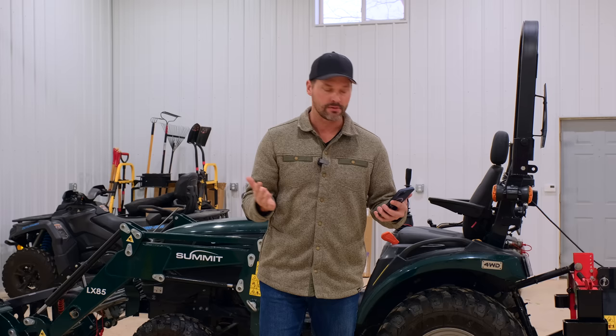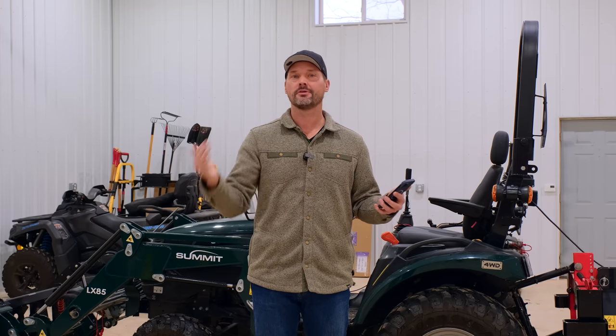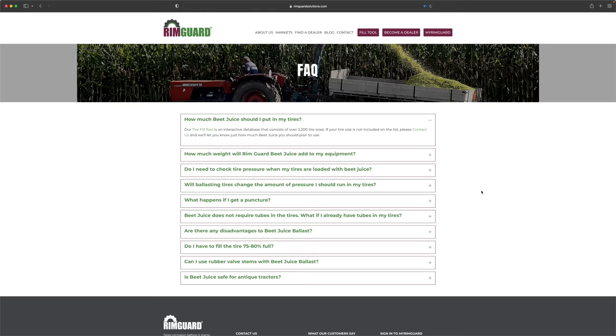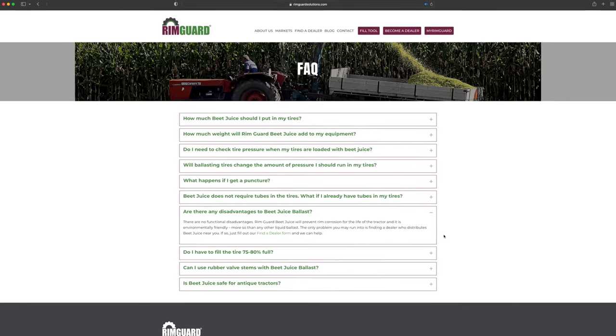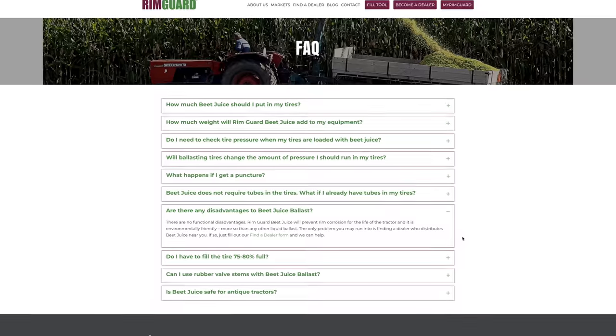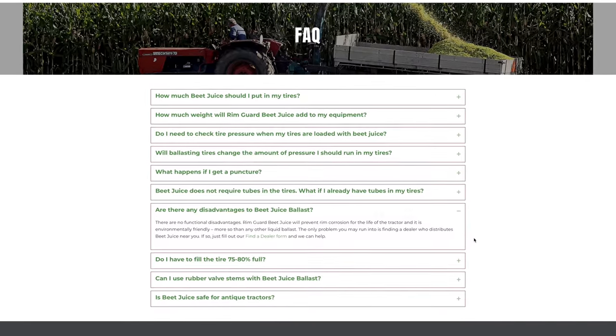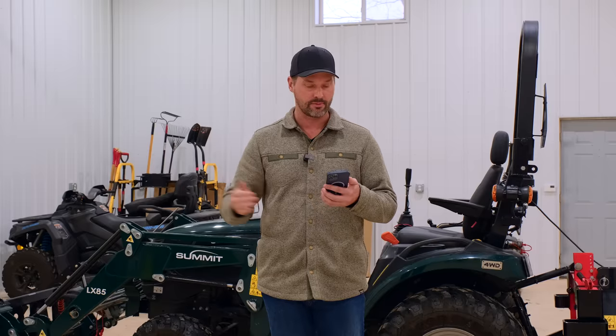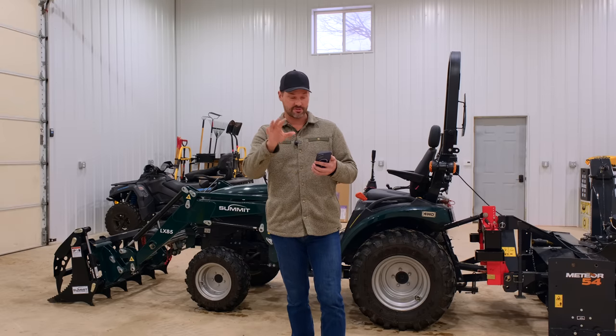So first thing I did logically, I just went right to RimGuard's website. They have an FAQ page, started scrolling through those FAQs, and I found this. Are there any disadvantages to beet juice ballast? I don't know, maybe like corrosion, for example. And they say there are no functional disadvantages. RimGuard beet juice will prevent rim corrosion for the life of the tractor, and it is environmentally friendly, and a lot of other things that we've talked about. Okay, so that addresses the corrosion side of things.